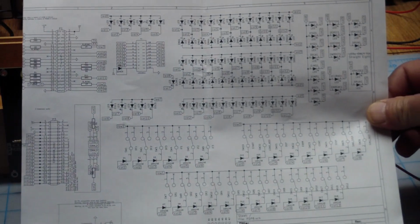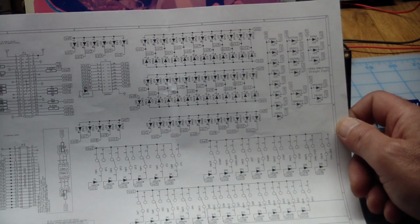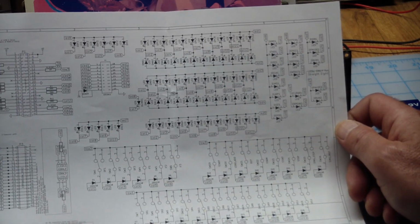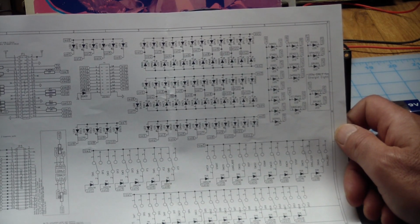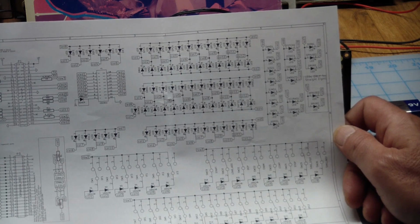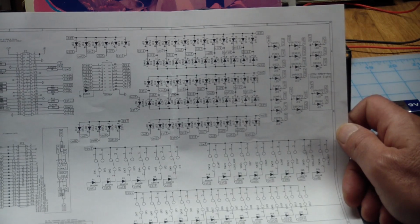So I went to the website and I actually found a schematic of the front panel. And it seems that the LEDs are multiplexed, and what that means is that instead of using a data bit from the Pi, one data bit for every LED, you can't do that because there's too many LEDs on there. So what they do is they scan the LEDs, which means they're in a row-column configuration. And if a particular column is turned on, then they read 8 bits. And those 8 bits and the column that they turned on will define what the state is, whether the switches are open or closed.